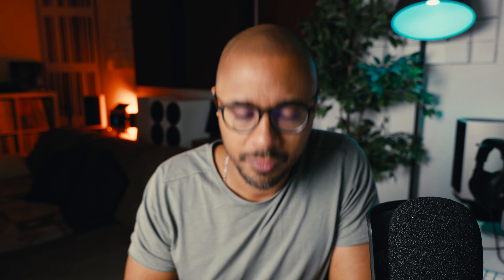Looking at the speaker, a couple of things jumped out immediately. First is the position of the tweeter — with the mid-range driver at the top and the tweeter at the bottom of the baffle. The reason for this upside-down arrangement is related to homogeneous radiation behavior and better acoustic integration into the listening room. To control directivity there's a waveguide on the tweeter, making it perfect for untreated rooms and giving a wide sweet spot. To phase-align the drivers, they also lean the cabinet slightly backwards.